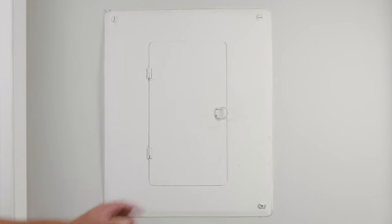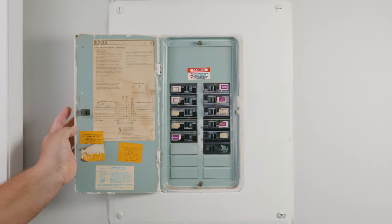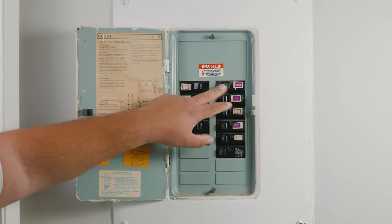The third most important thing is not to die on a clear sunny day, and we achieve that by turning off the breaker to that particular switch. For more precaution you could turn them all off, or turn off the main breaker.